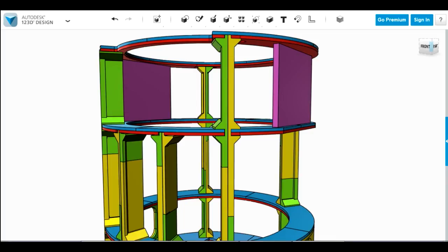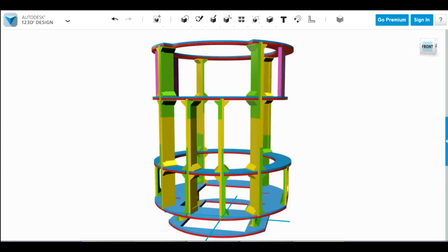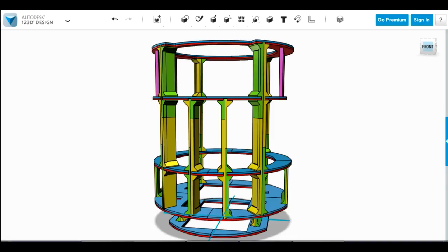The green and yellow upright pieces are separate pieces, all cut into lengths which fit diagonally on the print bed so we can print them all out. Then we acetone-weld them together — I'm going to print in ABS, which melts in acetone, so we can put the whole frame together that way.